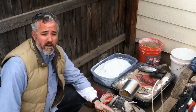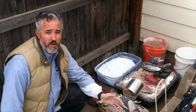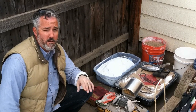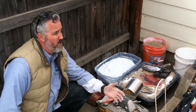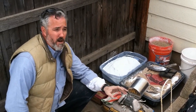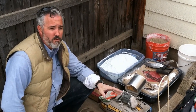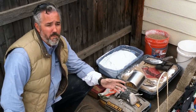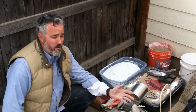It's not a bad mortar mix. It's a weak mortar mix and it does need tuck pointing over time, but it's got the ability to flex and move. On these old homes, a lot of the brick is a sand brick — the old brick wasn't fired as hard as new brick. So if you come in with a new type S mortar, even a type N mortar, it's too hard for the brick and it doesn't match anyway.